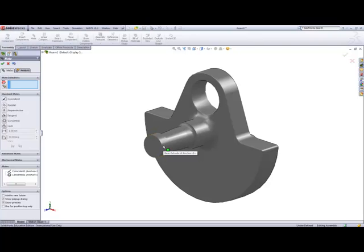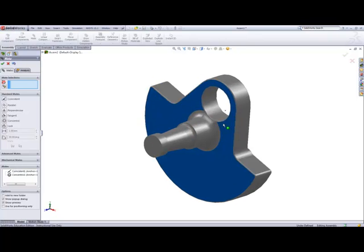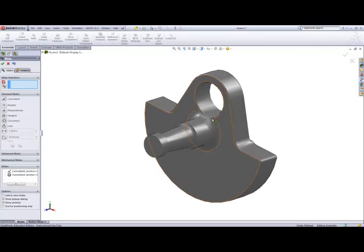Okay. Now, you remember before I explained that we brought the anchor part in first. The anchor part is there because we don't have the cylinder block here for these parts to rotate around. So to enable that motion, we need a dummy part in effect just to ground it. So that's why the anchor part is there.